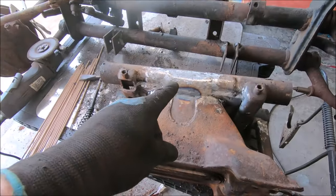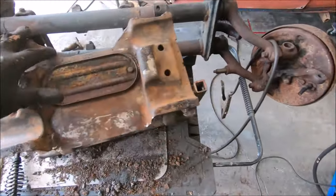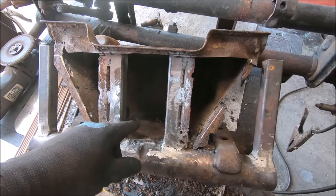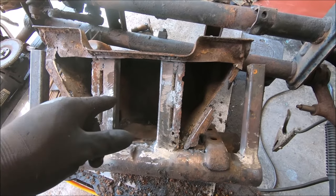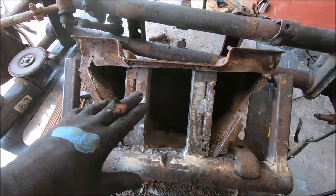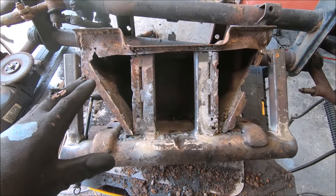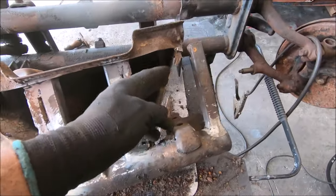So we got the plate on, we got the side bars fully welded on. This is the fun part right here. We cut the bottom open, so we welded the frame head to the beam on the inside, so we have outside-inside penetration. I know it was a little rotted, so we cut the bottom out, put in these two 1x1 by 3/16, real thick. All we got to do now is kind of clean up the outside some.